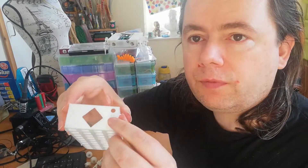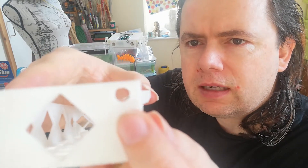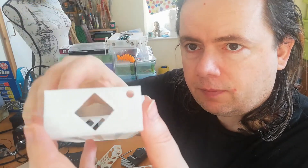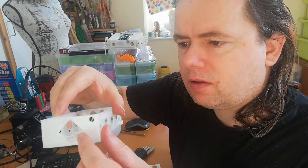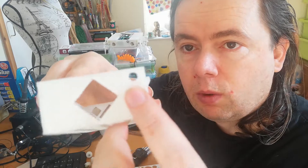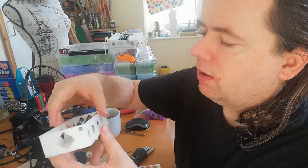The reason we didn't use circles is illustrated here — there's a hole for the switch at the back, and if you look very closely you'll see there's a little droop at the top, because at the top we're almost printing straight across, basically pouring molten plastic across nothing. To solve that we use 45-degree diagonals, which don't droop as badly. There's also a trick where you put a 45-degree triangle at the top of a circular hole — same idea but more effort, so I didn't bother.